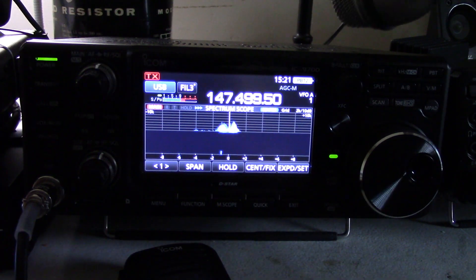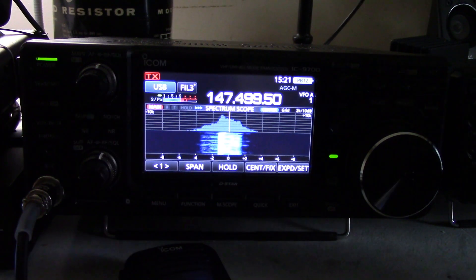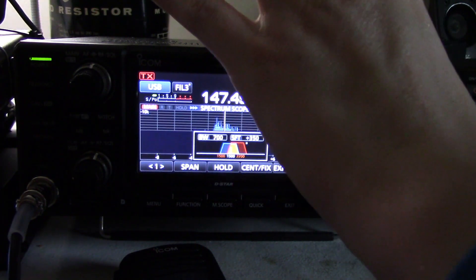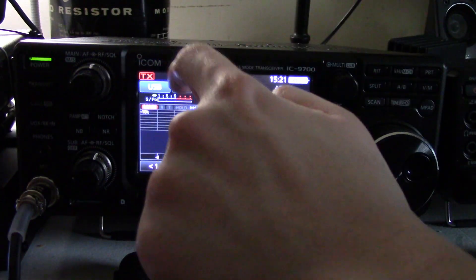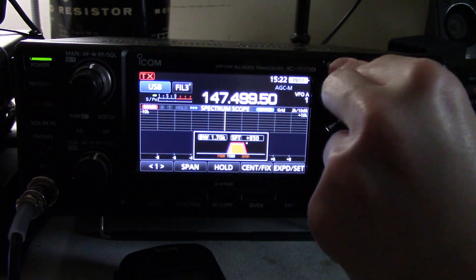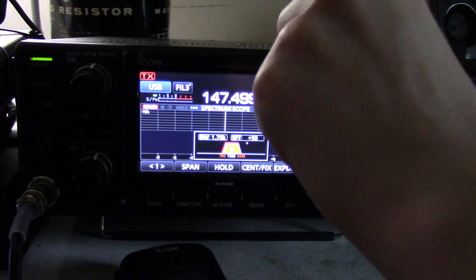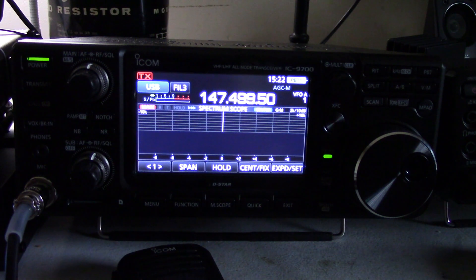Of course if I talk it's going to sound kind of distorted, but nonetheless you can just kind of barely make out what's being said. It takes a little bit of mental gymnastics to understand what's being said, but it's doable. So this right here will give you your proper IF shift. You probably want this just to be set to default. We can crank this back to the default here, but that's where your shifting comes into play. Note we have a custom — you see that little dot on the 3? That's how we know it's custom. If we cycle it over to 2 we can bring that back to default, and we go back to 1. You're tuning both frequencies of the IF — what you get in and what you get out. It's a little bit complicated but something you probably just want to mess around with.